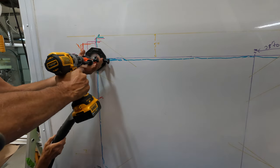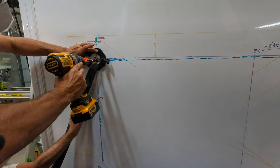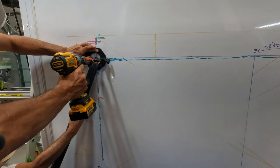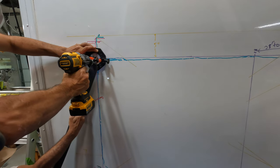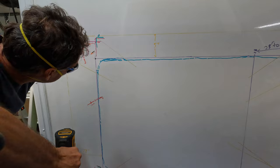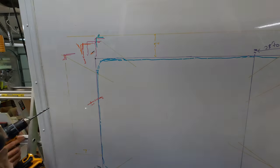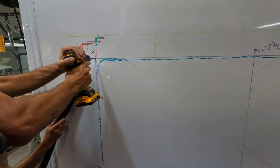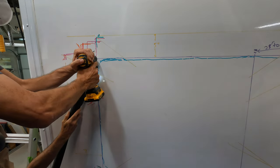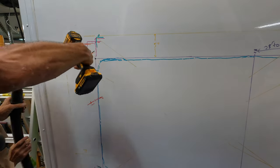Look at that up there. There we go. All right. There are two things going on here that are really key. One is I'm using a drill guide to ensure that the holes I'm drilling are perfectly perpendicular to the wall panel, in part because I have to drill through from both sides because this panel is 3 1/4 inches thick, a little bit deeper than some of my drill bits, and especially the hole saws will drill. And also those hole saws have to actually be drilled out a little bit in the corners because they're creating both the strain relief as well as a cavity for the trim to go into.